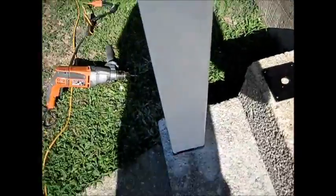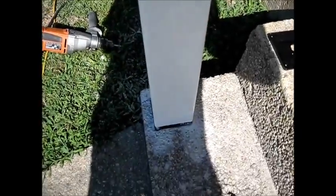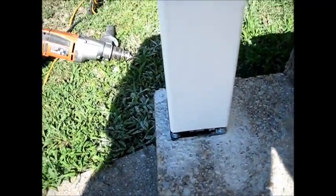To finish off the post, grab your sleeve. Take the insert that came with the mount, put it in one end, turn it upside down — it's a channel fit. Slide it straight down. You can see inside the sleeve; it may wobble, but the insert will actually position it and keep it rigid. For the finish product, before the rail section goes in, a bottom skirt gets applied over it to cover up the mechanical parts. The top gets its own cap and the rail section is ready to be installed. Thanks for watching.